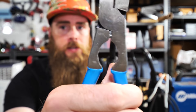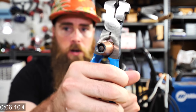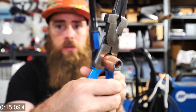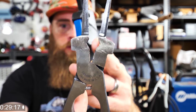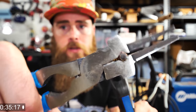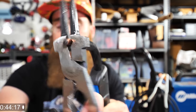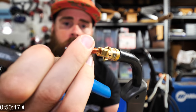The second use is this little part right here — if you look at the front of your MIG gun, you can pull this off to remove the tip. That's good for when you need a good grip on it, and also a lot of times this can be very hot. Now you see right here on these pliers, that is to remove the wire tip. You got the little feed that's gonna be your certain size that you need. To break that off or tighten it down, you can use that portion of these pliers, and it just makes your life that much easier.